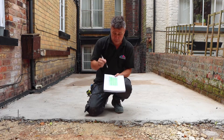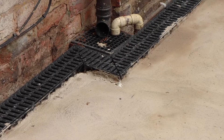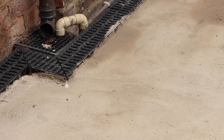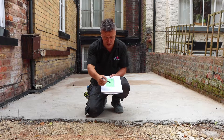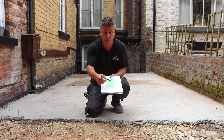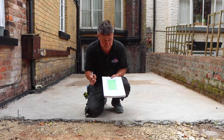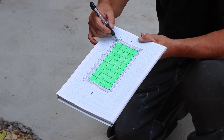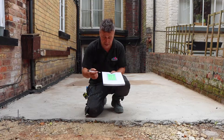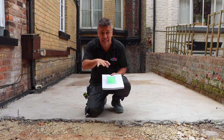My area here is not quite a rectangle — we've got a bit of a dog leg where the drains come around and the building steps out a fraction. So I'm going to go a little bit offset from the centre and stagger it slightly, so that when I come further down in the patio area I'll have a larger cut here which will balance the area out.